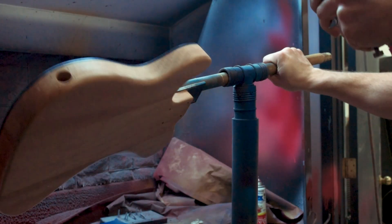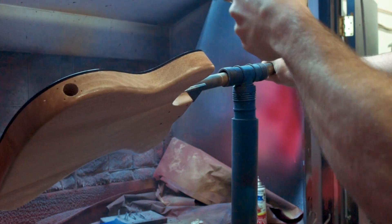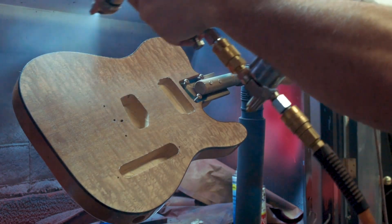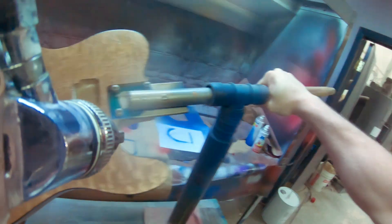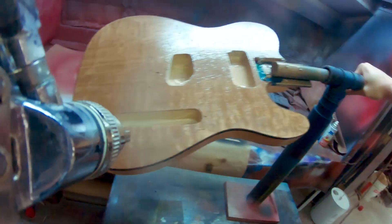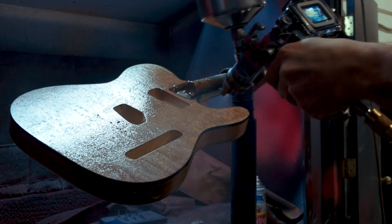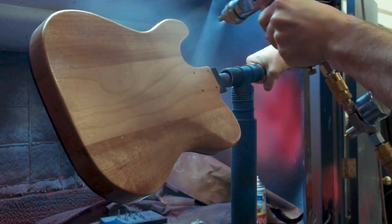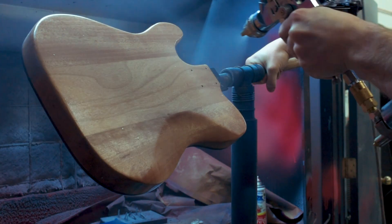For the sealing work, I use three coats. It takes about 45 minutes to dry to the point where you can sand it, but what I like to do is three coats 10 to 15 minutes apart — like I generally do with these solvent paints — so that they bond together without having to sand. Then I give it three days to really dry up so I don't have to worry about any solvents trying to escape from the sealer through any subsequent layers, such as through the nitrocellulose lacquer that I'm going to be putting on next.